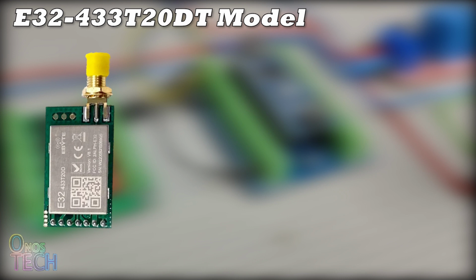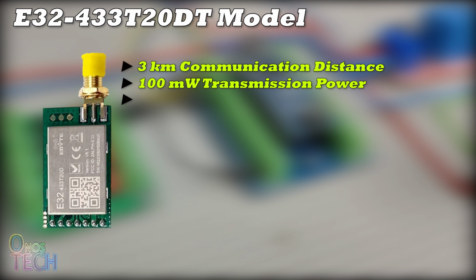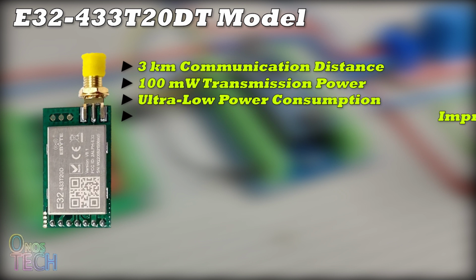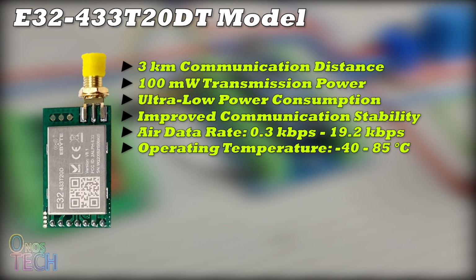E32-433T20DT model has a lot of nice features, among which are long distance communication of up to 3 kilometers with a maximum transmission power of 100 milliwatts. Its ultra-low power consumption will allow for extended battery life. It supports FEC forward error correction to improve communication stability. The air data rate is between 0.3 kilobits per second and 19.2 kilobits per second. It is designed to operate in an environment of minus 40 to 85 degrees Celsius for a long time.